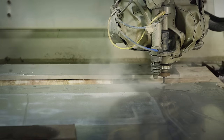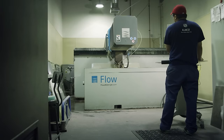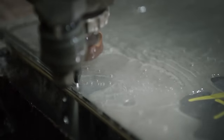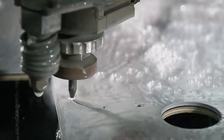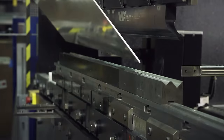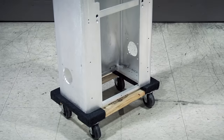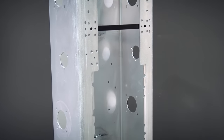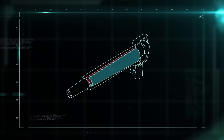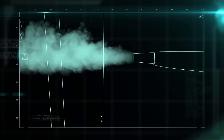The chassis is the guts of the robot, and what gets it from A to B. It's made from sheets of lightweight aluminum, and each part is cut using a water jet. Water and sand combine under very high pressure to make a precision blade that slices through the metal like butter. Then the sheet is bent under 88 tons of pressure to form the chassis frame. Once formed and machined, the chassis is sent to a paint booth. The aluminum walls and the air gun are wired with opposite electric charges which attract, so the thick coat of powdered paint magnetically sticks to the surface.